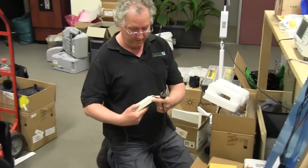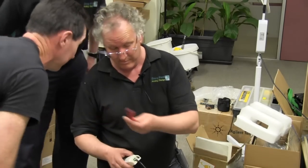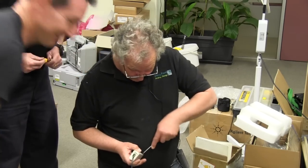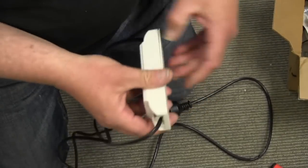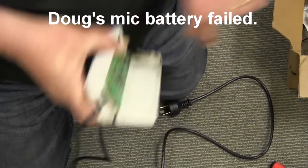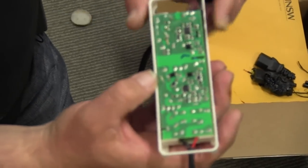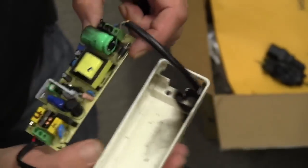How many LEDs per strip? There's the joining connector - eight LEDs per strip per 600mm segment. Is 600mm probably the limit based on PCB panel size? I've been told there are companies not in Australia who can manufacture strips up to 1200mm in a single pass, but that's pushing the friendship in physical handling during SMT loading and soldering - and you'd pay a premium. You may as well make them the limit of a regular panel so anyone can manufacture it and stick a connector on. These have been locally loaded and assembled by Ramsonics - and they've done a damn good job of it.